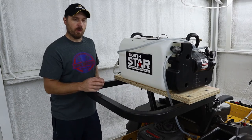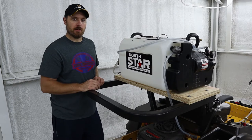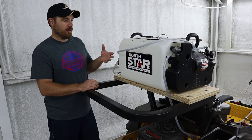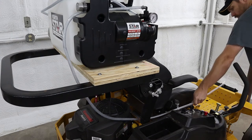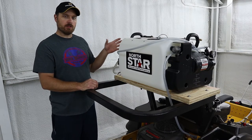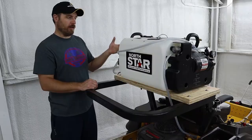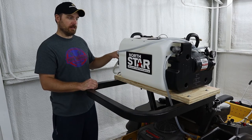To make that setup work, I needed a longer hose. Normally the short hose — about two feet long — connects to the boomless sprayer, and then you have the long hose for the wand, which is about 10 to 15 feet. Basically what I did was switch the hoses: I put the long hose going up to the front of the machine connected to the boomless sprayer, cut it at exactly the length I needed, and had about five feet left over — that's what I connected to the wand. Most of the time when I'm spraying with the wand, I'm just sitting in the seat, so I don't need 15 feet of hose. A short hose just works fine for how I'm using it.